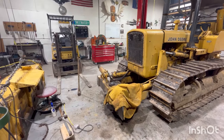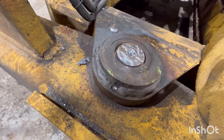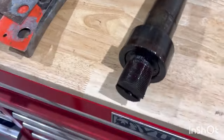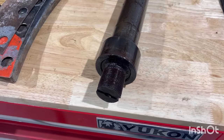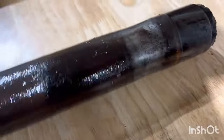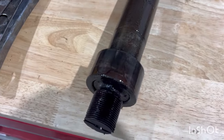That's the ticket - it's finally moving, it's actually flush with the top now. Let's get that damn thing out of there. That makes sense - the lower bushing came out with the pin. That's no big deal, I can cut it or put it in the press. There's a lot of wear right there, you can actually see a sway back in that pin. Kind of makes me wonder if we're gonna have to build it up and turn it back down on the lathe. Like I said, you can't get that bolt anymore.